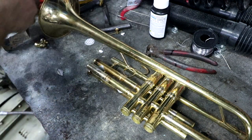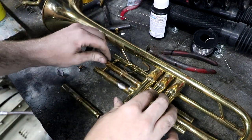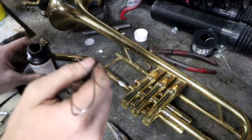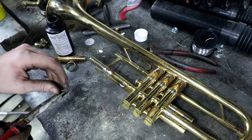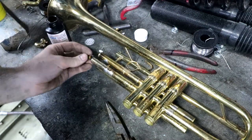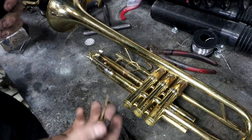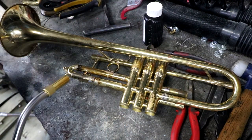Slide these all into place — then heat it up and touch the solder to it and it should all solder back together. This one goes on, slide this little reinforcement thing in here, the top piece, and there's another little reinforcement thingy that goes in there. Then we've got this piece which now fits because the hole it goes into is a circle and not a hexagon. The little adjusting thingies I'll solder on at the end because they'll need to be wired on. This is all sitting as straight and as square as I can get it by eye, so there's nothing left to do now — start soldering.